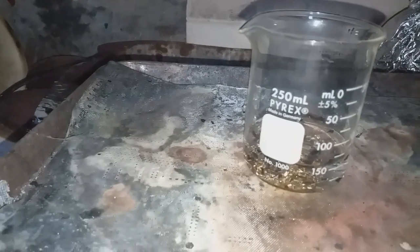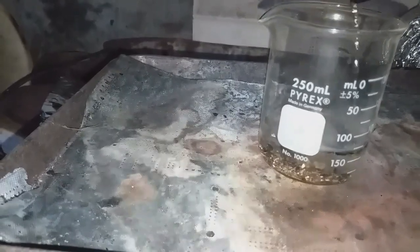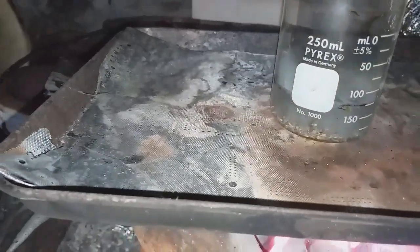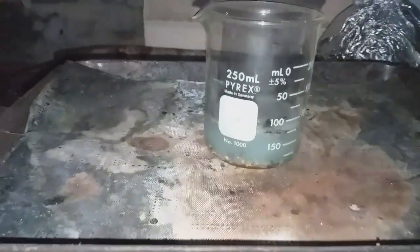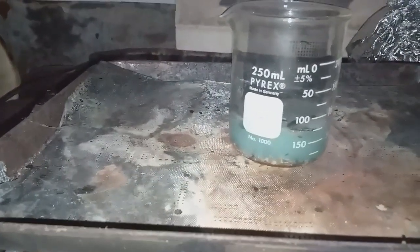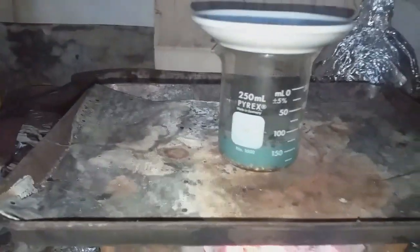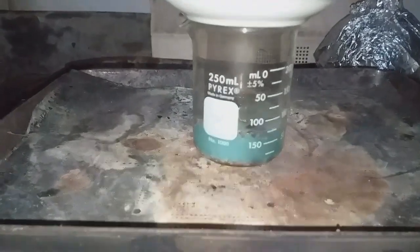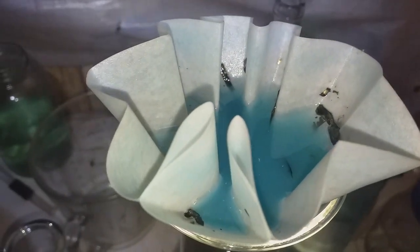This is the connector and we are now dissolving base metal. I add 50 ml water and slowly add hydrochloric acid — 50/50 — to remove base metal. The reaction is immediate. Let's take a cup and turn on our hot plate.